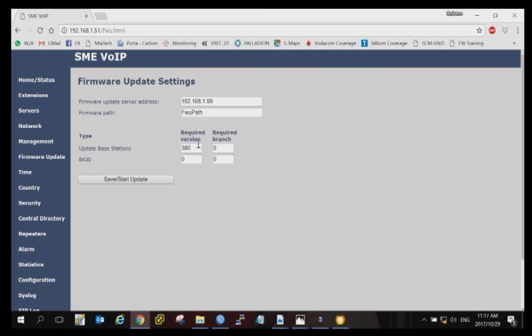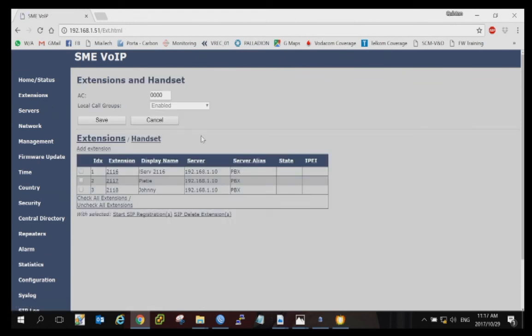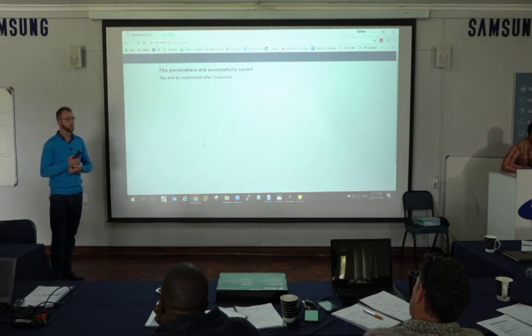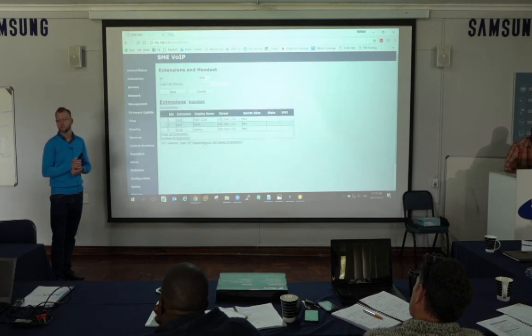Sorry, we just wait for the handsets to register first. Mine is saying searching. Dylan, can you just go to extensions for us? Register them there again, send in another request on the extension. So we're just sending another request to let the handsets register. It should re-register automatically as soon as the base boots up. That's the preferred way of how it should work. But for some reason, I think it's something on the PABX that it's just not allowing it.